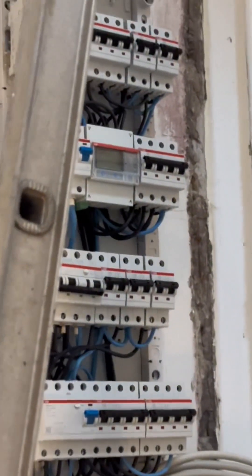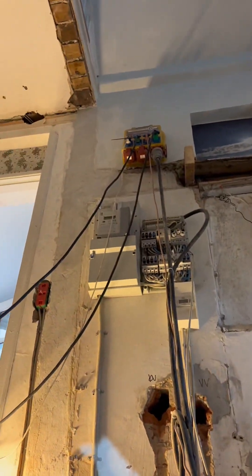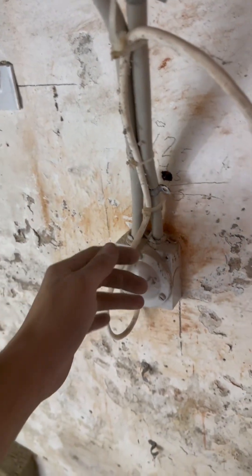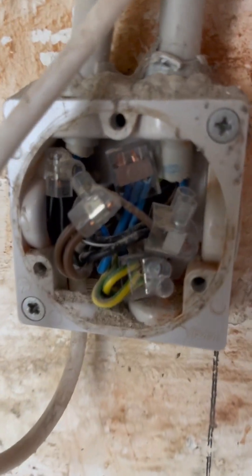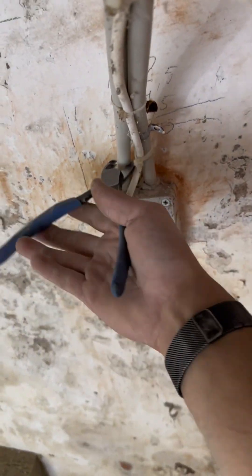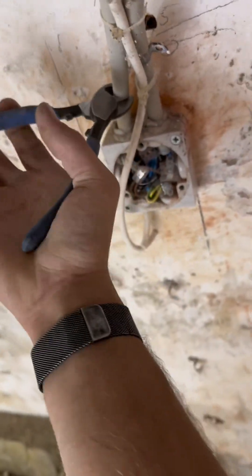First thing is, customers are still living here, actually in another building, so I'm going to pull off all of the cables and also mount them on the same day, because we need power back again. I saw this weird junction box — we have 16 amps for a cable that can only take like 5 amps or something, this tiny cable in the bottom. I looked inside and I'm like, I don't really want to cut this. So let me just take my handy little scissor here and cut this — it's not needed either way, we'll find a solution that's a little bit better than that.